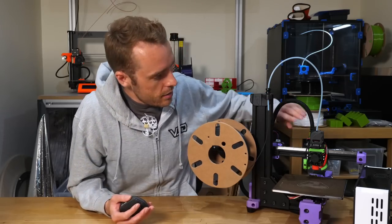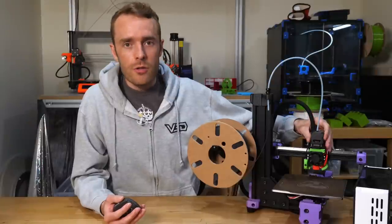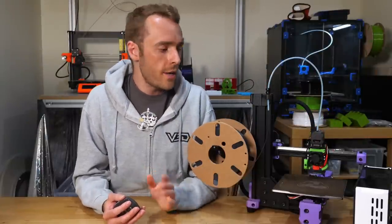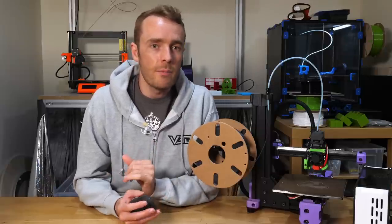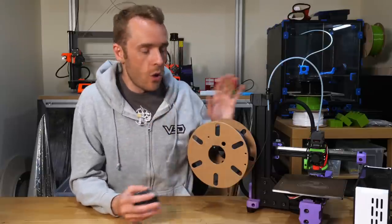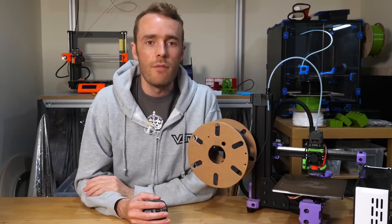The EVA modular carriage system — the assembly of hotend, extruder, and surrounding parts — continues to be a really good, flexible system with assembly-ready designs. You just print them off and it supports a whole load of different extruders and hotends without any modification needed. The original kit comes with EVA 2.4, but upgrading to EVA 3.0 brings a more rigid extruder-to-hotend mounting, a better cooling duct, and the option of threaded inserts.